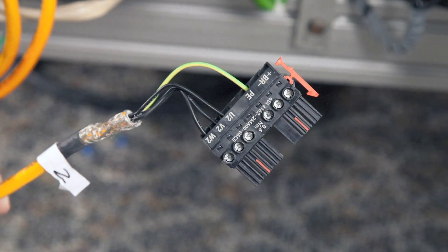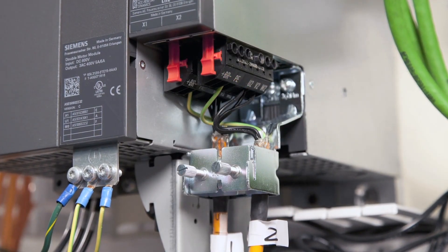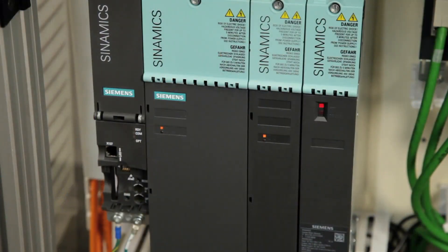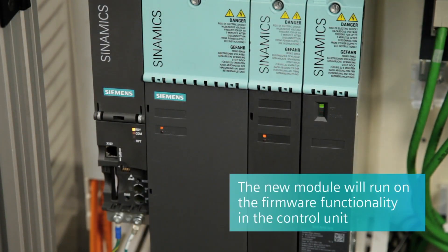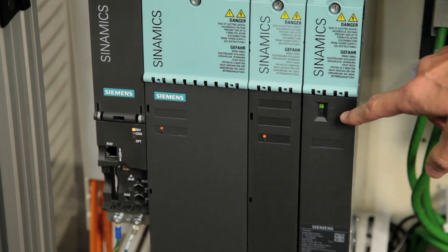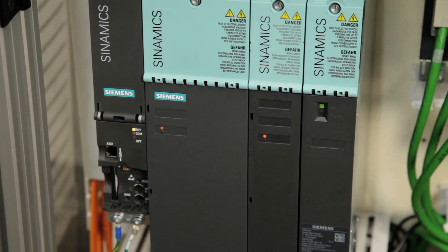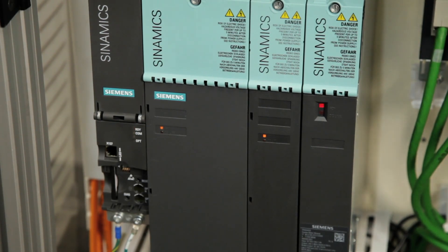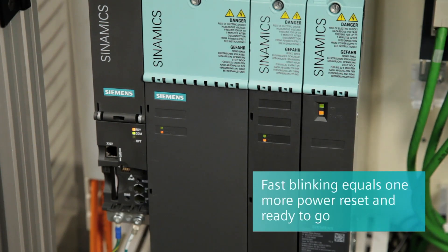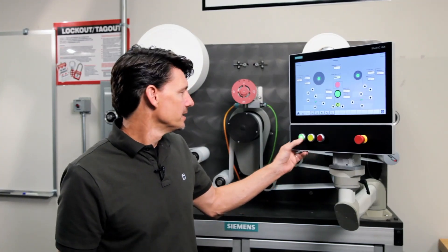Here I've wired the two motor cable connectors and am ready to connect them to the new D-type motor module. The new connector and side-by-side connection make this very easy. Finally, check to make sure the grounding is connected and everything is tight and in the right place, and we're ready to power up. The new motor module will run on the firmware functionality in the control unit, because the firmware is stored on the compact flash and is now being loaded into the new motor module. This means we're not going to have to do any parameterization. As the firmware is being loaded, it will have a slow blinking, and as soon as it's completely loaded, that will change to a fast blinking. We'll power reset it and then everything should come back green. We have the fast blinking — now we'll do one more power reset. Now that we're powered back up, we need to acknowledge any faults, and we're ready for the run command. It's that easy.